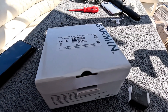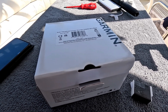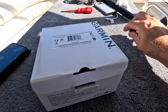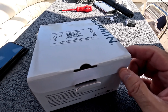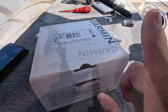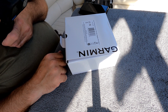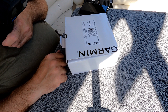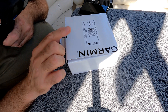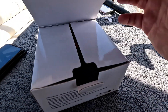When I was installing the chart plotter, one of the problems I came across was that I have a transducer already fitted in the boat. I know it's a dual frequency transducer — it's perfectly good and works really well with the chart plotter I've installed — but the plug is the wrong plug. It's got a six-wire plug on it, and the new chart plotter comes with a 15-pin plug and an 8-pin adapter.